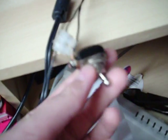The fire alarm — the new one, which I made myself — has a microswitch down here out of an old dishwasher, so when the door shuts the light goes on. There's a pulsing buzzer, a test switch down there, batteries for the light, and there's the backup 9 volt battery for this buzzer, and the 12 volt transformer.